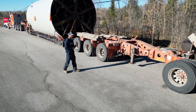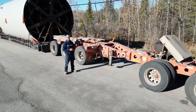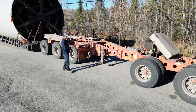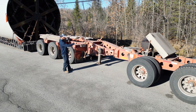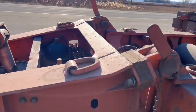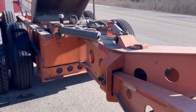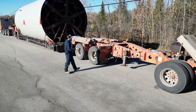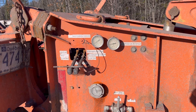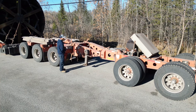There are two main categories of boosters: you have your shimmed walking beam boosters and you have hydraulic boosters. This one's a hydraulic. There's a little pony motor at the back which runs a hydraulic pump, and there's a great big hydraulic cylinder here which is used to transfer weight from the main trailer onto the booster. I've got my controls right here and my air gauges for the main trailer and for the booster.